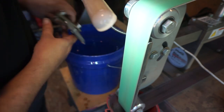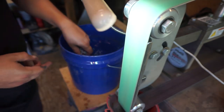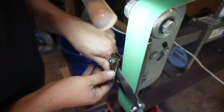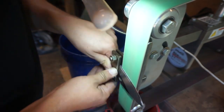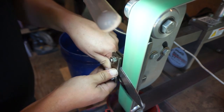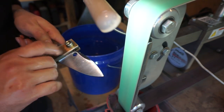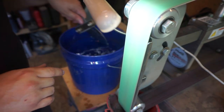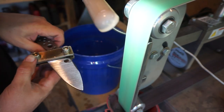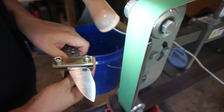We'll just take our time — put a little bit more pressure on the spine of the knife as we're holding it flat against the belt. You want to start rocking it back towards the spine and it will feather that bevel from the edge all the way back. Just a little more pressure each time slowly starts pulling it back. My goal here was to get it almost all the way to the spine — we still have to do a couple of different grits of belts, so you don't want to go all the way to the spine on the 40 grit ceramic belt.